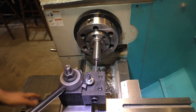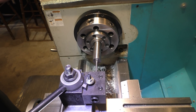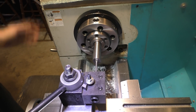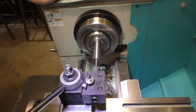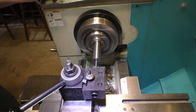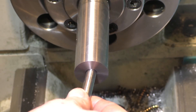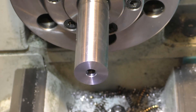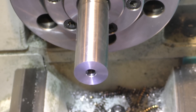We've switched to a solid carbide boring bar. I'm hoping I can pull this off without too much chatter — I'm going to slow the RPMs down more than I normally would to try to avoid chatter. Solid carbide can only go so far. All we want to do is clean this up and go straight with it. It went a whole lot better than I thought it would, though there's a bit of vibration. Gauge pins are the best way to measure when it's small like this. We're right at .380 and need to get up to .500, so there's a little bit of boring to do.